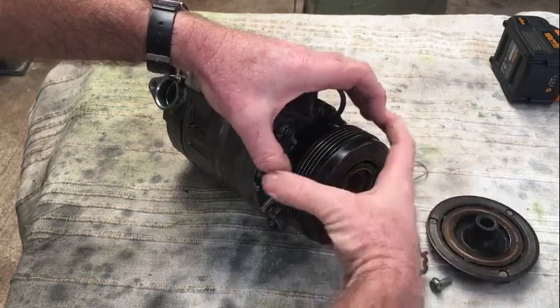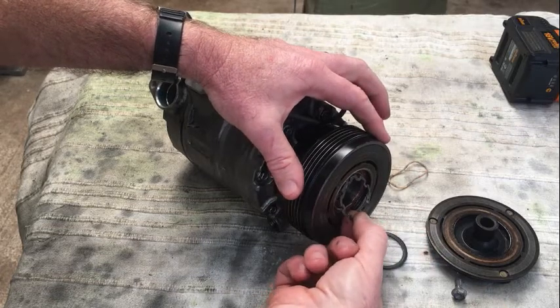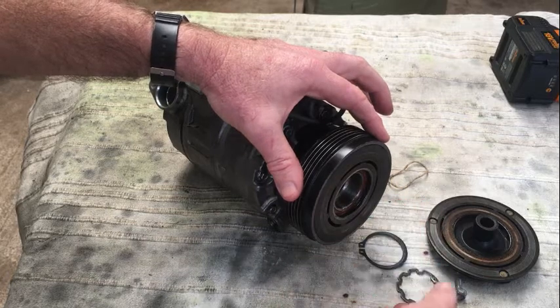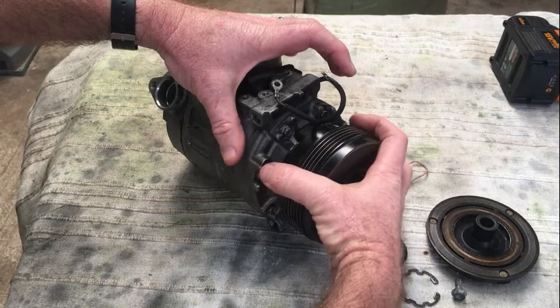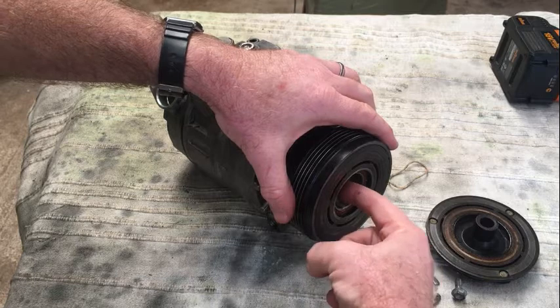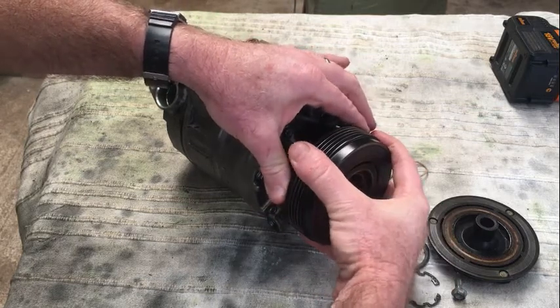When you're removing this it's actually pretty simple — you just remove the circlip from the inside which goes around that shaft, and that holds it in place. Then the easiest way to do it is to get a three-arm puller and just gently pull that off — just put the screw on the shaft and it gently pulls off. I didn't even have to use a spanner; it just slides off very nicely.